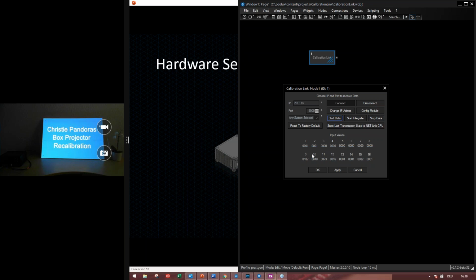So let's start the data again. As you can see, from number 1 to 8, nothing is happening because no connector is connected there. I have connected my four fiber cables from 9 to 12. So this is why you will see them jumping a lot and at higher values. From 13 to 16, nothing is connected either, but they will still get some light if the connectors are not closed properly. So you can screw them closed to not get any signals.